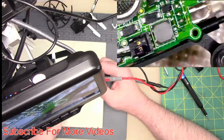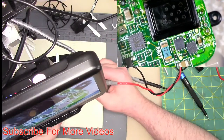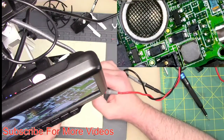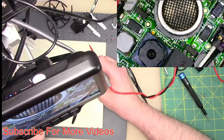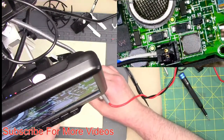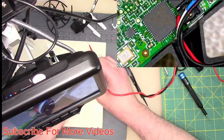One set there. Not quite sure what this is going to be. Not quite sure what that's going to be yet. So it appears that the board is loose. And looks like we got 1, 2, 3, 4 boost converters, one for each motor. So they're running one central power supply that provides 3.2 volts, and then they're boosting it individually per motor. That's what it appears.